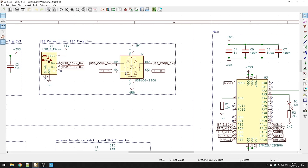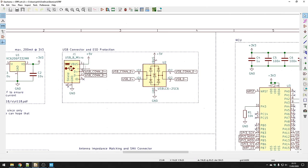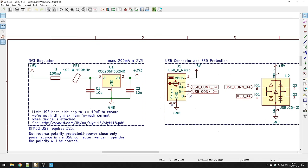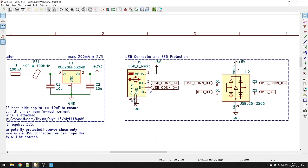I'll show more of that when we get to PCB layout and routing — we're routing from the STM32 through that ESD chip and then to the connector. The USB connector has strictly defined pinouts: pin 1 is the 5V which goes through the fuse, through the ferrite bead, to the regulator. We have data lines — data plus and data minus. The ID pin we don't need, so I use a no-connect flag. Ground is connected to ground. The shield pins are not grounded on the PCB side, since the shield is grounded at the host side per the USB specification — we don't want current to flow through the shield and induce noise.